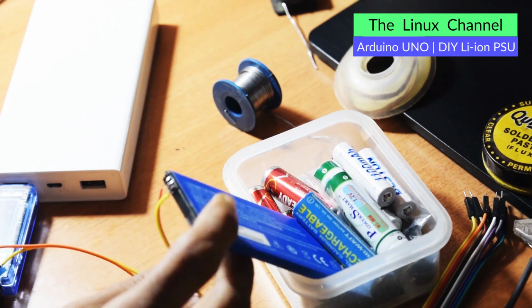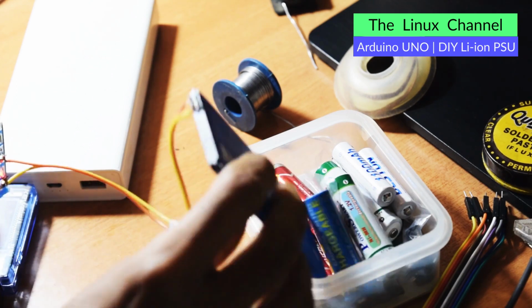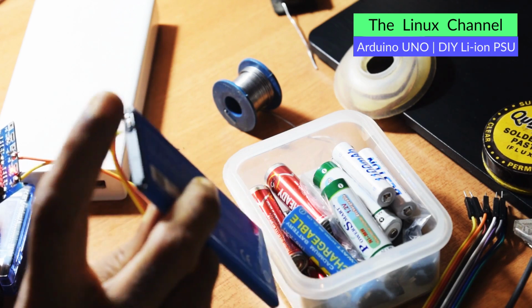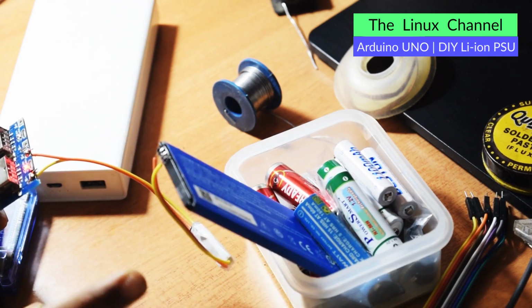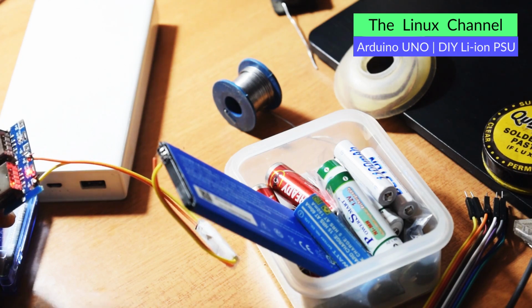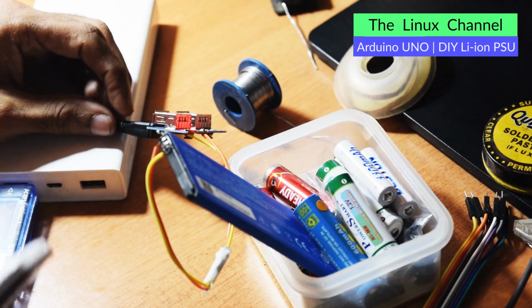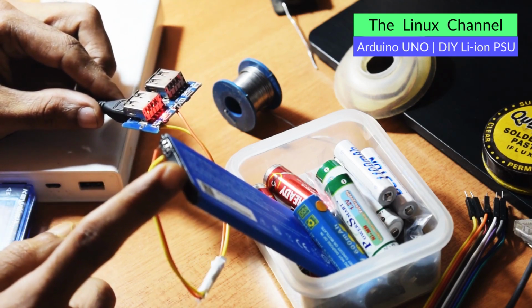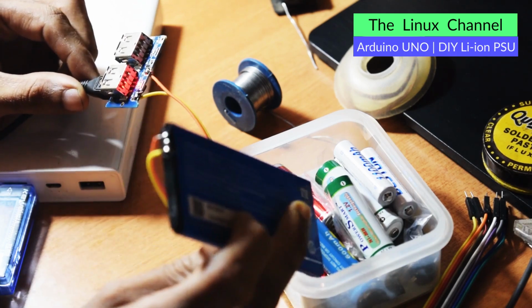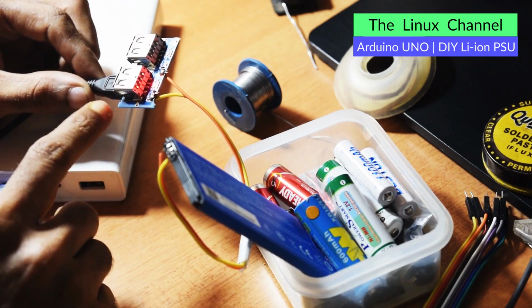I need to check, maybe this battery is not accepting the charge, or else it is just momentarily accepted and then it is not accepting, because it is not a regular 18650. I'm not sure whether this battery has some logic where it is not accepting the charge. It is cutting off, so I need to investigate. But one thing is, I can of course still charge this through some rig out of this phone, and I can use it for portable projects, which is fine for me because I don't need this phone anyway, and I can expose these terminals and charge that. But I need a standard 5 volts out of this battery where I can power such tiny boards portably. So that is my requirement. I need to investigate and check. I am still suspecting that the battery is cut off and it is not allowing me to charge.